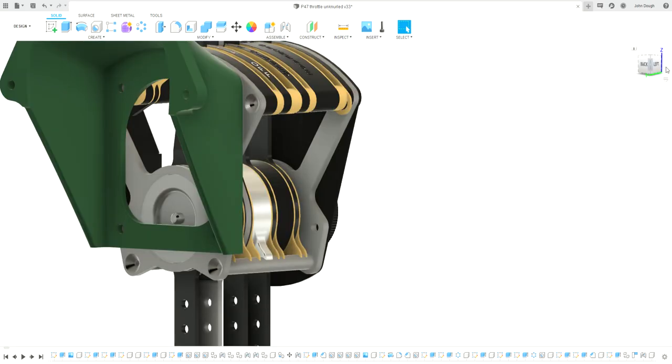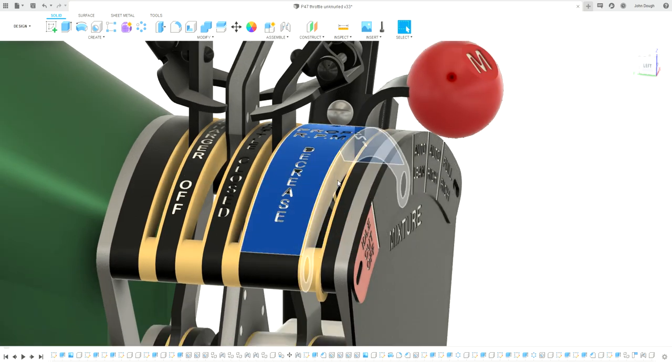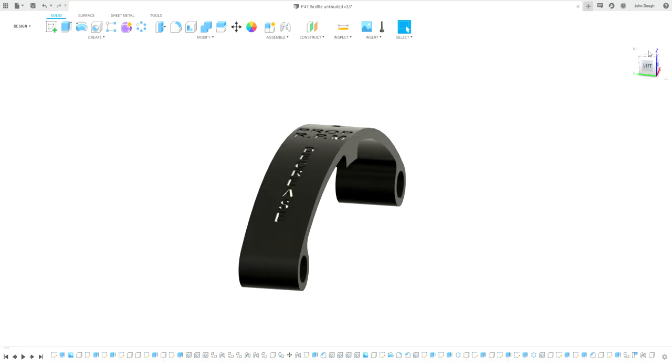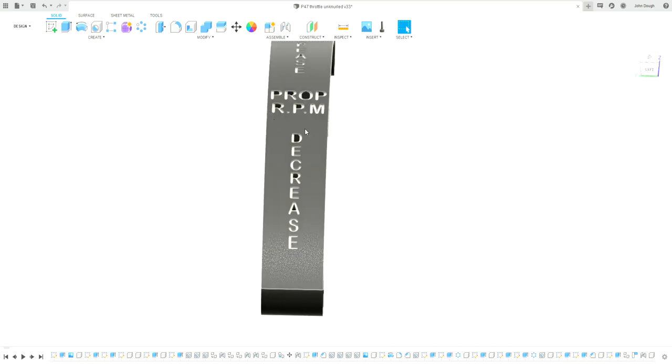These radius sections — I've been trying to make them but I had to get a long mill cutter because I was trying to cut this one but the mill flutes weren't long enough and it just clogged up, chewed, and went horribly wrong. For these parts — looking at the 80mm radius section — I've rationalized a lot of the sizes because I can get metric stock so much more easily. For instance, this was originally three-quarters of an inch, some weird English size, but it's about 18 millimeters.